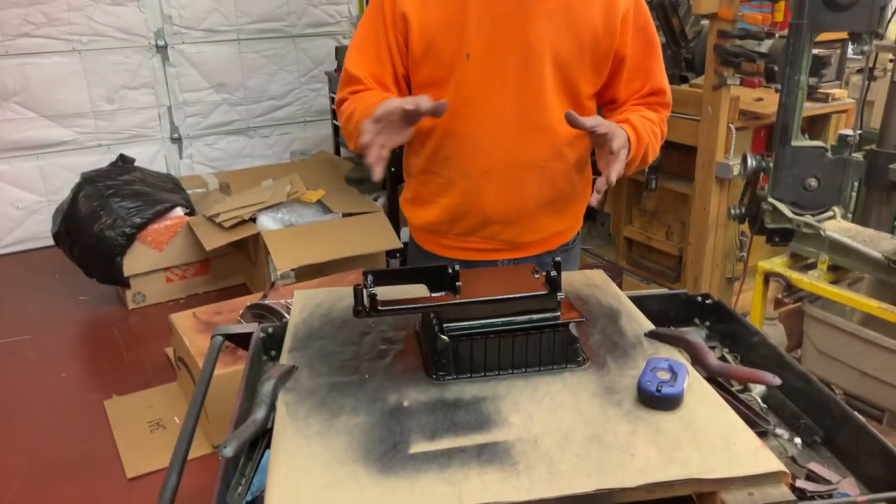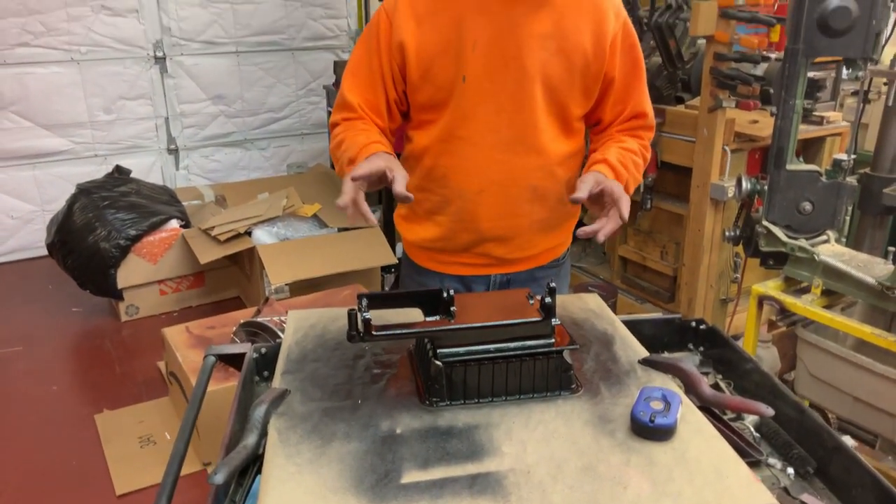When you do these, you want to do a light coat, sand it down, wipe it off, make sure there's no dust on it, and then shoot it again. But you want to make sure you don't smell the paint before you go to the next coat.